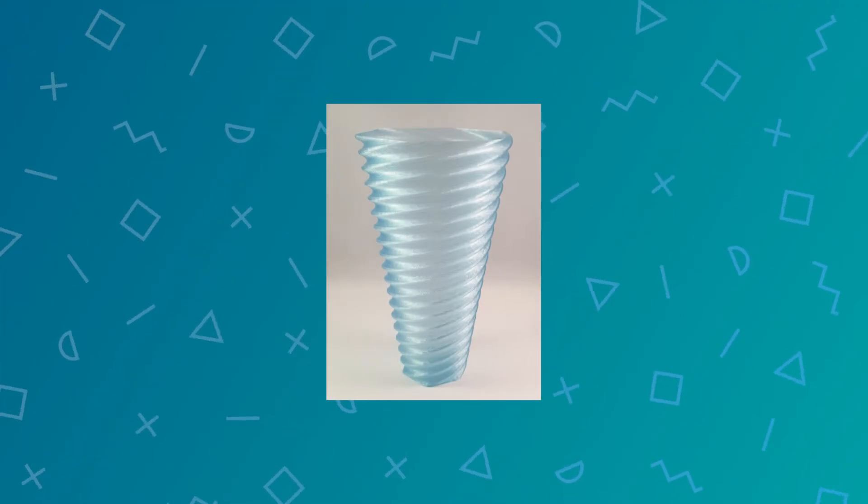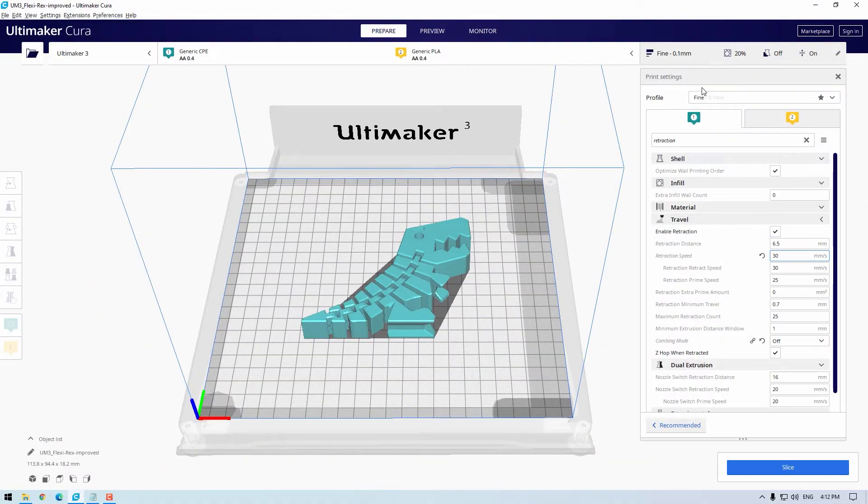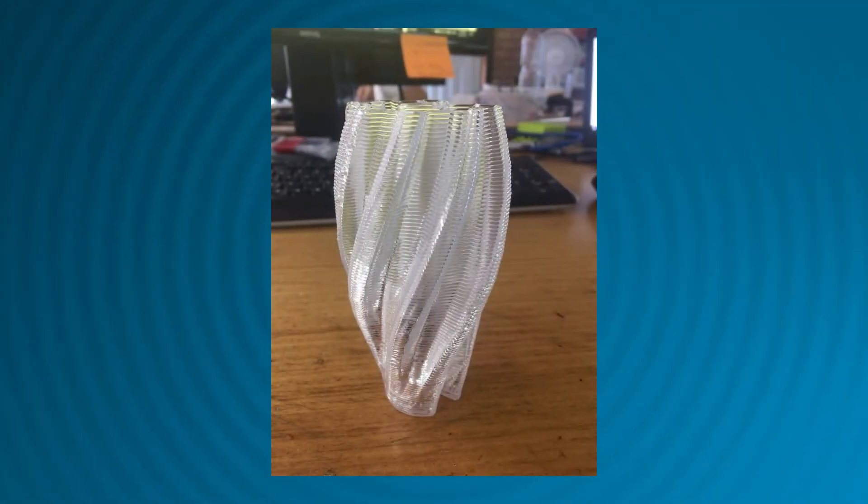When it comes to creating single-line vases or objects where translucency is desired in the X or Y plane and strength is not necessary, I use very different Cura settings. I start by increasing the actual nozzle diameter by swapping it out, then increase the layer width and layer height — in Cura this can be done easily by using the fast print profile. The goal is to make large cylindrical lines so that internal refraction is minimized. Here's an image of a vase made using layer lines of 1.2 millimeters, and you can already see how much more transparent and see-through it is before even post-processing.